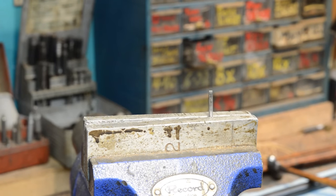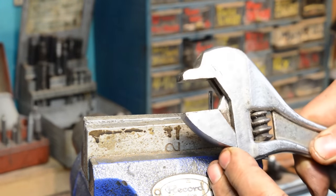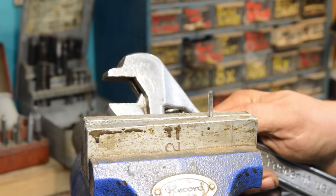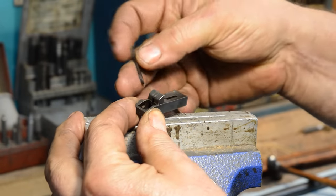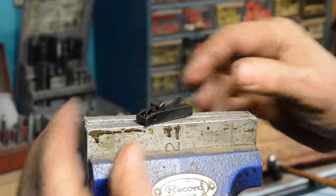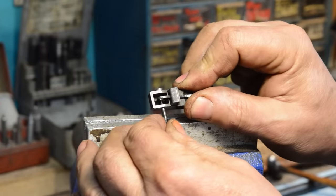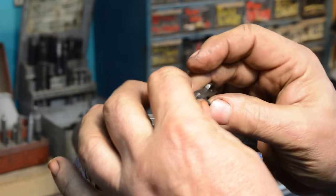Use the vise. Use your tools. Cut them if you have to. Let me show you an example of a tool I had to modify — what happens if you have to put the left-handed barrel nut on the Hotchkiss? You take a crescent wrench and you grind it to the right profile. This is $20 maybe $30 of the kit and you're working on $20,000 worth of gear. Modify your tools as necessary to do what you need to do. The last part of this is going to be to insert the actual ejector part in there — it just pops down in there. These ingenious guys, when you go to put this gun together, gave you this really sharp tip screw so that as this goes in, it collects all that as you drive it in, and it will allow it to just go in when you pop on it.